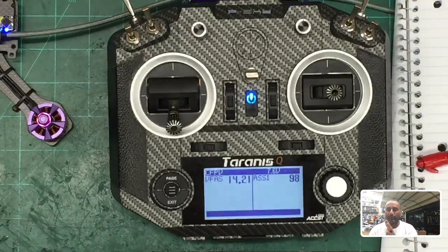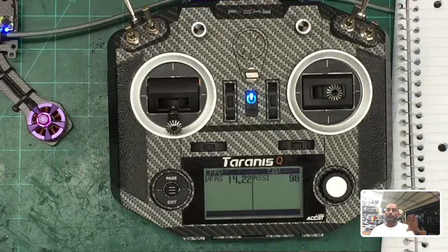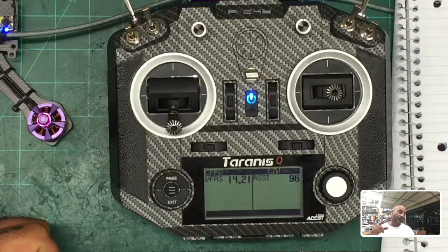I hope that helped. Sorry if my explanation was messy — there's a lot to cover. The idea is: get your RxSR or whatever receiver to feed telemetry through your F4 board using soft serial, allocating the resource from another TX pad or LED pad to the soft serial pad, so you don't need a hardware hack and you don't need a different board. If you have questions, hit me up at tark@cyclonefpv.com. I'll share my notes and post instructions on the forum at cyclonefpv.com. Safe flying and good night — it's about 3:45 in the morning.